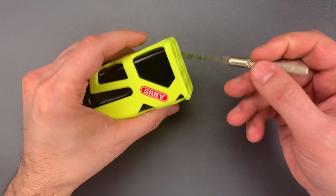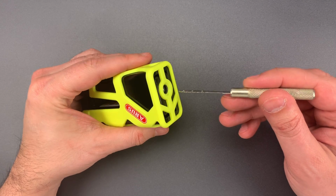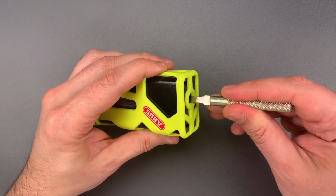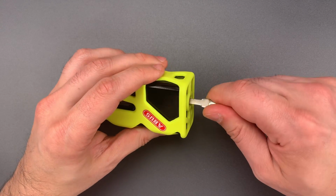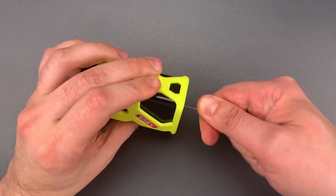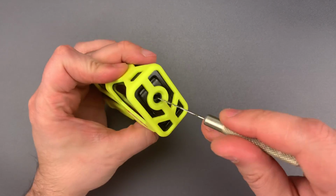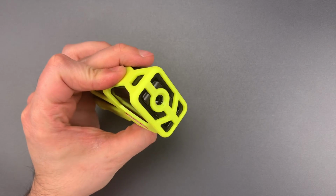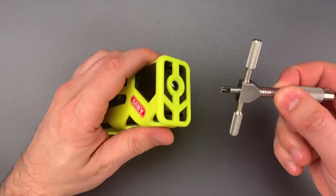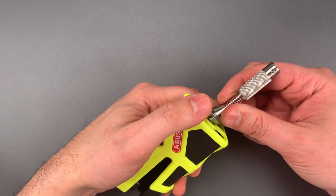The first thing we need to do is rotate all of those discs as far clockwise as they will go. And as I said, we have a disc locking system, so I'm reaching all the way to the back where those locking tabs are, putting a little bit of torque on that tool and just jiggling it around until those tabs let go. I've now rotated all those discs to where I want them to be. So we're gonna take out the pick that Bosnian Bill and I made, pick up disc number 1, and get to picking.